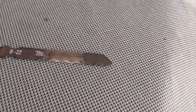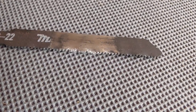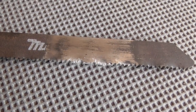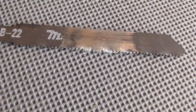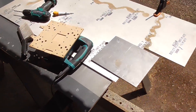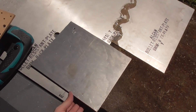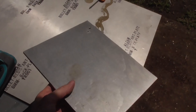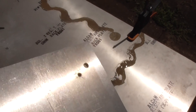I managed to cut that out without too much trouble, although I haven't done much jigsawing on metal and there was a bit of trouble because with my first blade I was trying to go too fast and got a kink in it - it seems almost impossible to get that out of the teeth so that blade's pretty much done. Fortunately I had another one and just went a little bit slower. It seems to be not too hard to work with so far. That's a six millimeter hole I drilled there - was pretty easy.